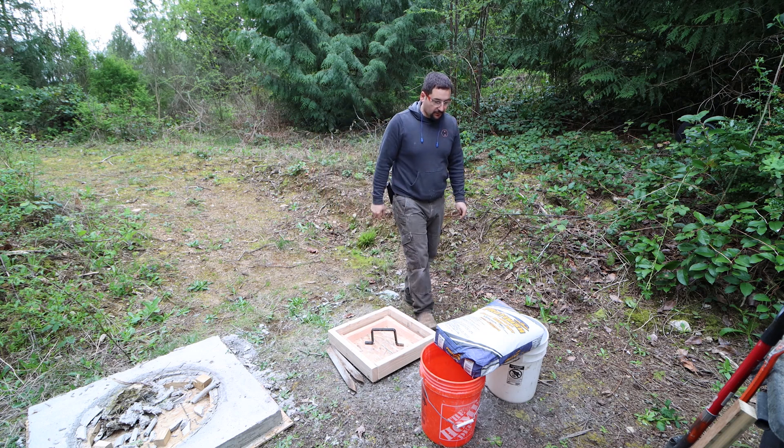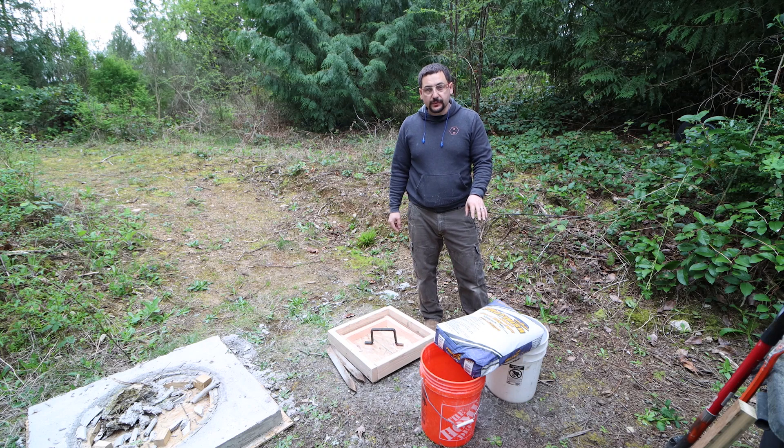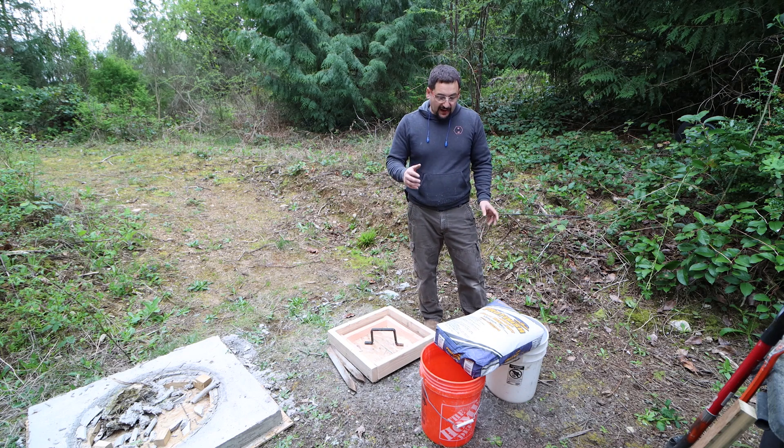This is one 80-pound bag of crack-resistant concrete, so this comes with fiberglass mixed into it. For one-bag jobs like this where I'm doing a casting, or even two or three bags, I like using the five-gallon bucket method, which is basically put half the bag in one bucket, put water in, pour it back and forth, add a little bit more, pour it back and forth.